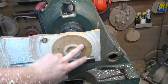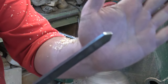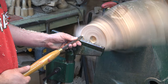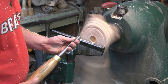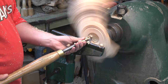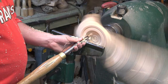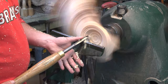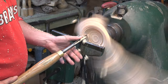We're going to focus now on hollowing out the bowl. We might make this into a box and turn a lid to go on top. I'm going to establish where the rim of the box is going to be with a little parting tool, then turn into the centre from there. I'm just using a push cut, rubbing the bevel of the tool, working down on the wall, leaving a tiny bit at the centre so I can check my depth before getting down to the final cut in case I go into that mortise.